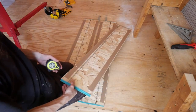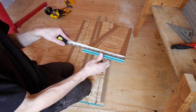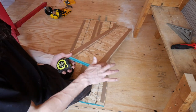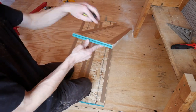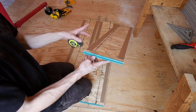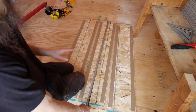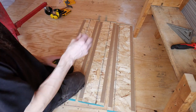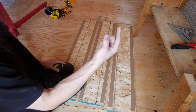There are three more boards ready to go. Nine inches wide doesn't have to be perfect, with an inch-and-a-half strip of shim on either side. These shims are about a sixteenth of an inch thick — that's plenty. Sometimes you might find them a little bit thicker and that's fine, just don't go too thick. This is full-width 48-inch OSB — get it as close to three-quarter inch thick as you can so your screws won't be poking up through the back.